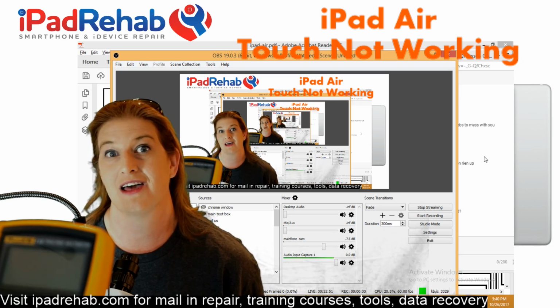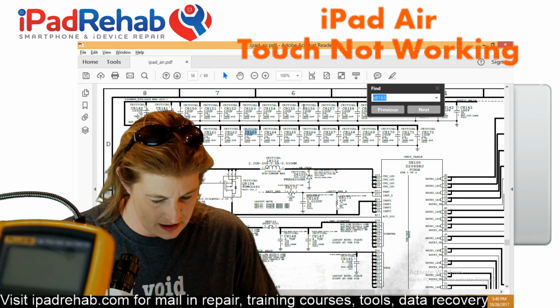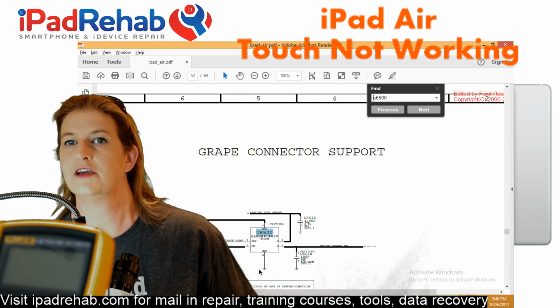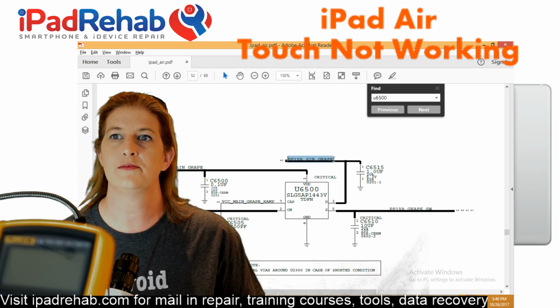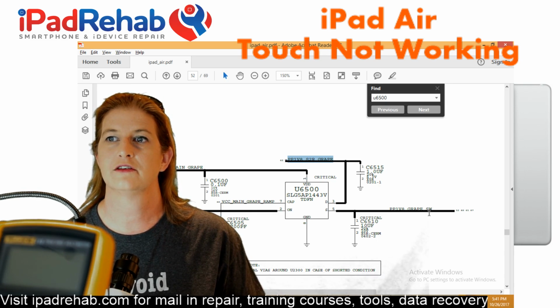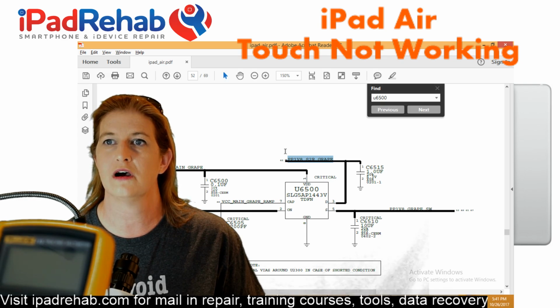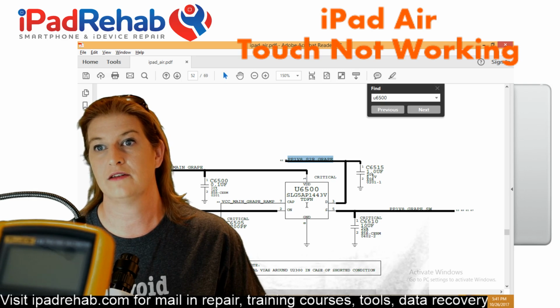So let's see. We've got a lot of choices of 1V8 that we can choose from. Let's go on a hunt and let's get back to our chip, which I think is U6500. All right, U6500. So what I want to know, I have this PP1V8S2R grape, which is supposed to become PP1V8 grape SW when told to. So what I'm going to do is just say, forget when you're told to. You're always going to be PP1V8 grape SW. You're not going to depend on being told anything. You are, for now and forevermore, going to become this line permanently, as if I just hardwired that connection together so that I wasn't dependent on any kind of logic.